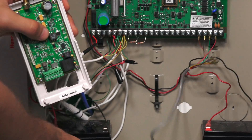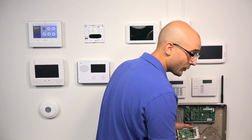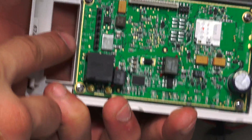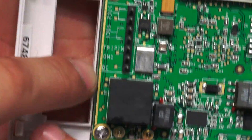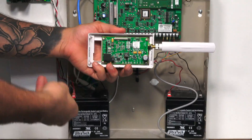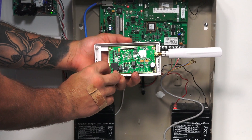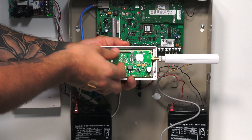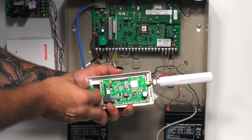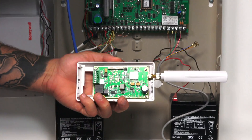Now, if you don't want to do that, on the TelGuard there's a little terminal block that comes off — it'll actually be off when you order one. You'll see right on the board it says GND and DC. If you're not able to use the RJ cable to provide power, you can attach wire to the terminal block on terminals 1 through 7 and connect those directly to the corresponding terminals on your system. Once you wire them into your terminal block, it's super easy to push it right down on the unit and you should be good to go.